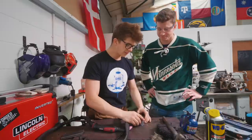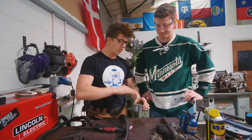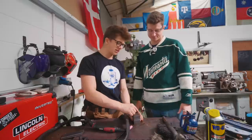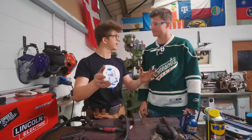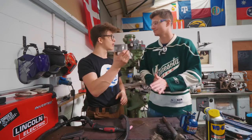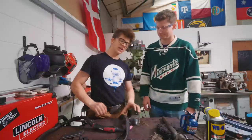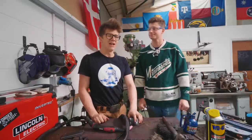So, when it comes to welding this, we're not gonna weld on the ends, we're only gonna weld on the sides because I don't wanna have to take off too much material on the ends because that's where our good pattern is. So we're gonna make sure that we clamp it all together as tight as possible, and we're gonna TIG weld down the sides. We don't really mind too much about removing material from the sides of this once it's said and done. Then it's gonna go back in the forge, and it's gonna be a case of forge welding it without holding on to anything, which is tough. I might end up doing a little more of that forge welding than you because I'm a little more used to the tongs, but that is why we took all that extra effort in tidying up those pieces before the forge welding.